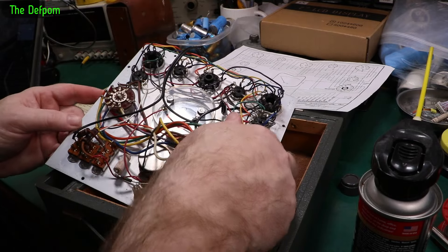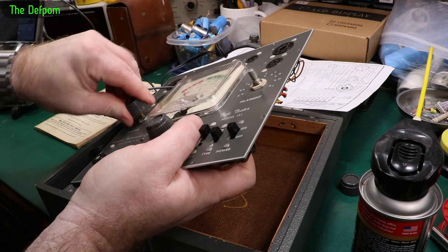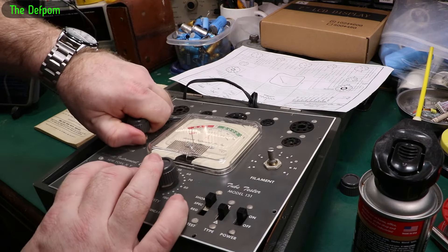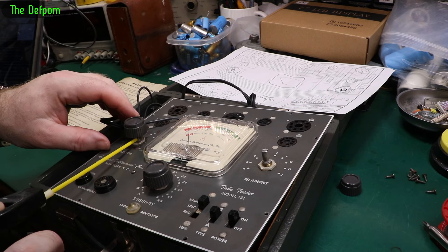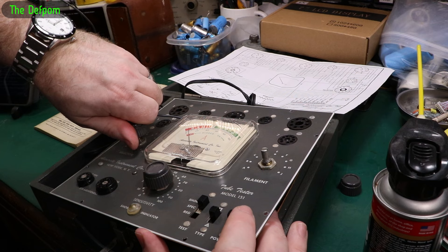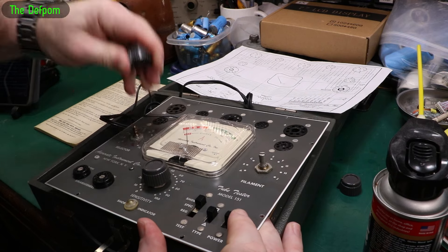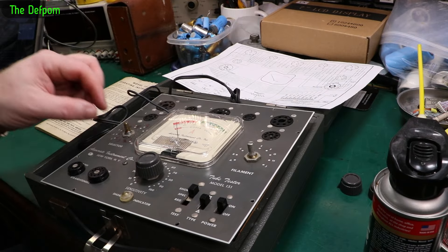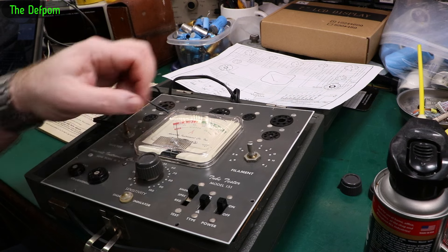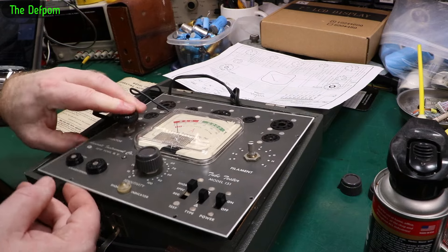This one's a bit harder. Can I pull the knob off this one? I can, and I'll stick this one on instead. It's definitely stiffer. I'll spray some on this side as well so it works its way through the shaft. Looking at the shaft on this, it actually looks like someone's had pliers on it and actually stripped off some of the knurling - it's actually damaged. It's not as pronounced as on this switch. That could be part of the problem, stripping out the knobs, because these are quite stiff with the knurling being damaged as well.